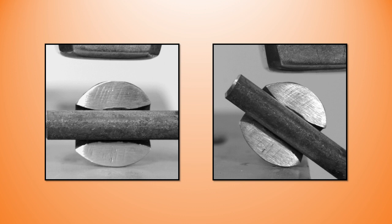Typically a welded collar welded onto round bar can be finished at the edge of the anvil after securing the weld on the flat face of the anvil. In this case, due to using a flat bar as a central stock — the central style is a three-quarter by three-eighth flat bar — we cannot get the hand hammer into position to secure the weld without causing damage to the flat bar.